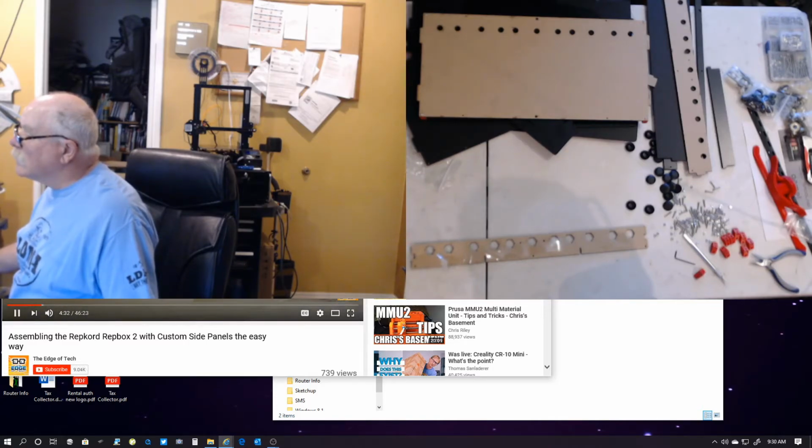Base panel. We're going to grab one of the rear exit panels. It is one of the ones with the hexagonal holes in it here. And we're going to take three of our screws, one, two, three, and put them in there. So this is what you got. Then what we'll do is we'll take parts bag H that has the seal, and we will open the seal.